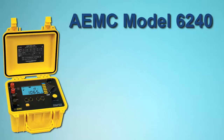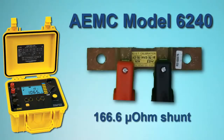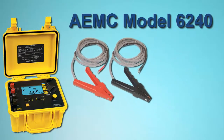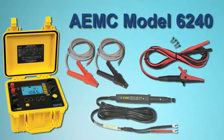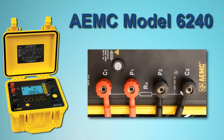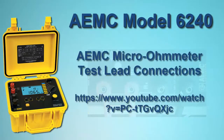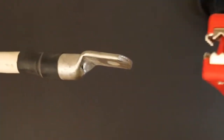For our demonstration, we will connect the instrument to a 166.6 micro-ohm shunt and run a 1-minute test with a current of 10 amps. To make the connection, we will use Hippo-type Kelvin clips. The Model 6240 also accepts alligator and spring-tip probes. Be sure all leads are correctly attached to the instrument's terminals, as explained in a separate AEMC video.